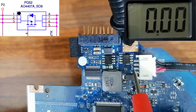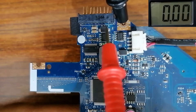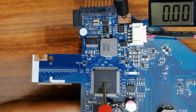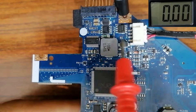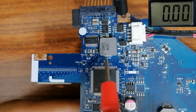The V_in is good for this motherboard. Here we have the DC connector and the battery connector, which means this is the charge circuit. Here we have the charge IC, and over here we have the Super IO — the IC responsible for power management across the whole motherboard.